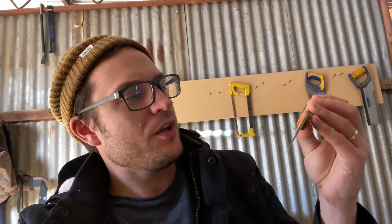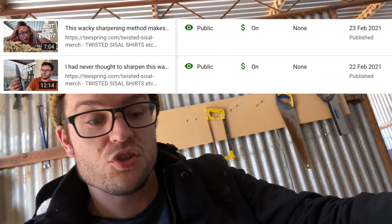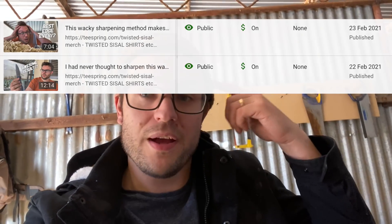So that's the more specific kind of dual grit sharpened edge. I'd comfortably step back to those first couple of dual grit tests — this version may be almost too high-risk, high-reward. You might get carbide tear-out or burr failure a little easier. But those first couple we did, where it definitely boosted edge retention with very little downside — those are still probably the best edges I've had so far. Edgelord adventures — being the right kind of edgelord in a knife community means being interested in different kinds of edges rather than spreading negativity. I'll see you all in the next video. Goodbye.